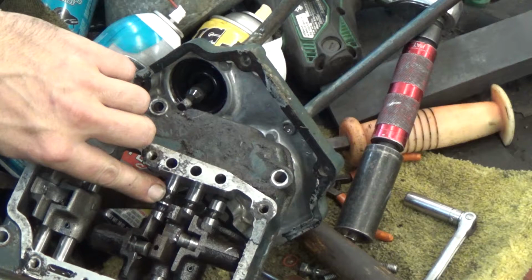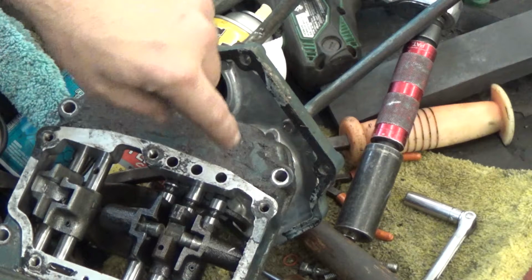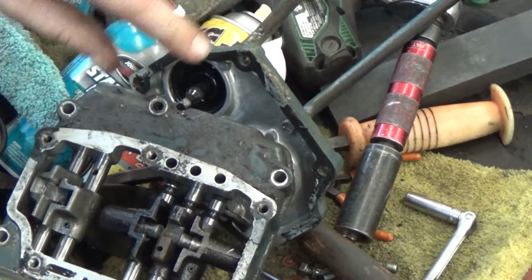It just totally jams it. I've also seen those springs disintegrate and/or come unwound, or they get worn out and real thin and they're able to work down past the ball, and that jams up everything. So that's a simple thing you need to look for, along with the rust on these rails.